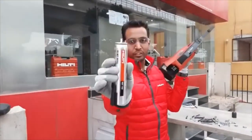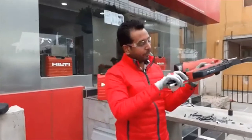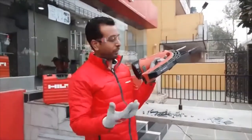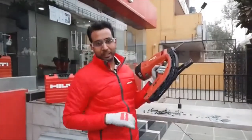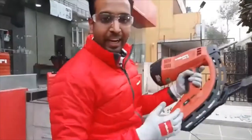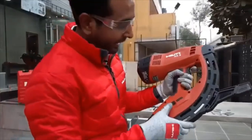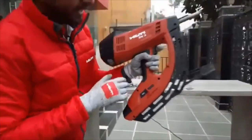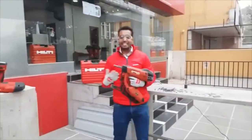This is the place where you insert the gas can inside — this is the Hilti gas can used for the GX3. With one gas can you can do 1200 fastenings using the GX3. Once you insert the gas can, you can also check how much gas is remaining by clicking this button — you can see the green light indicating the gas level.